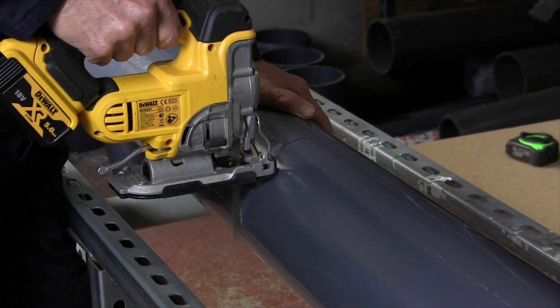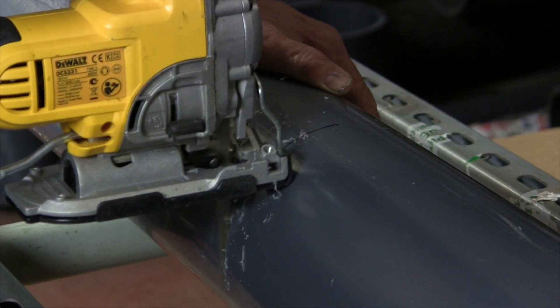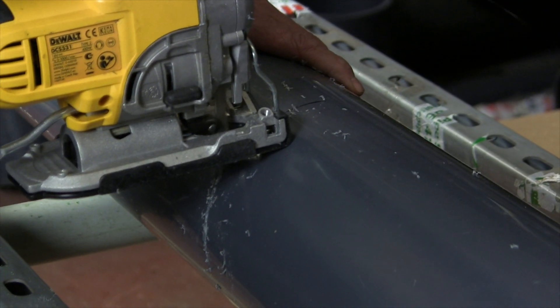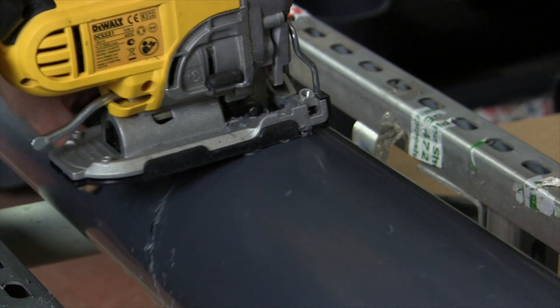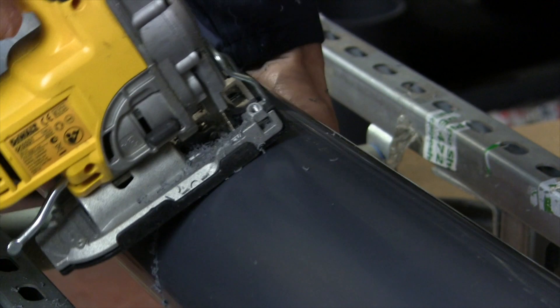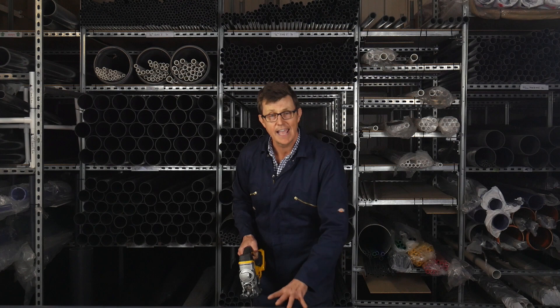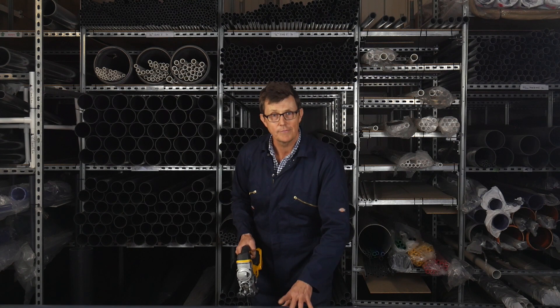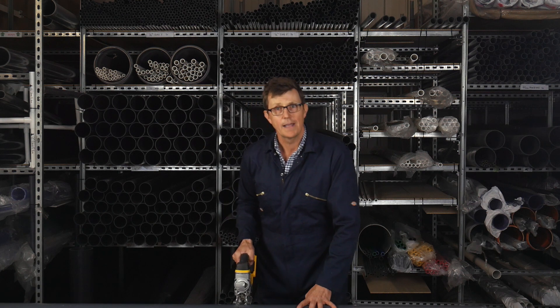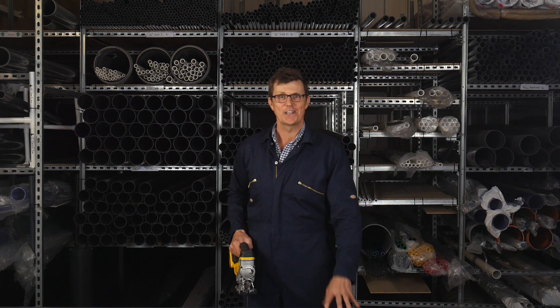Be patient and wait for the saw to penetrate the wall. Make sure the pipe is well supported on both sides to stop it snapping off near the end. Again, while cutting, let the saw do the work rather than pushing it. For large diameter pipes, this is by far my most preferred way of cutting using standard tools. It can take a little practice to get the feel of starting the cut, but once you've done it a couple of times, you'll be cutting like a pro. Thanks for watching. Bye.